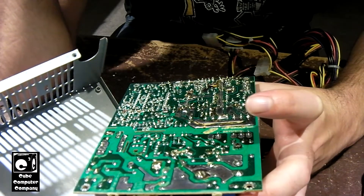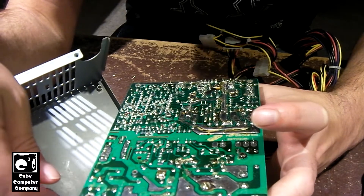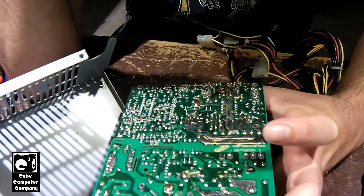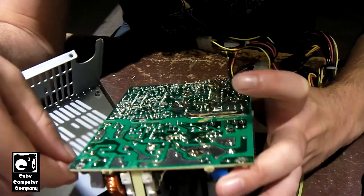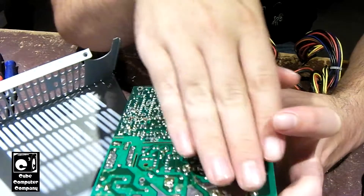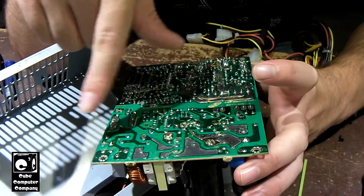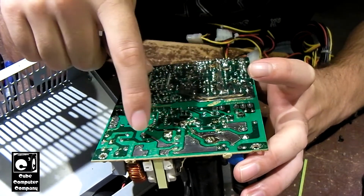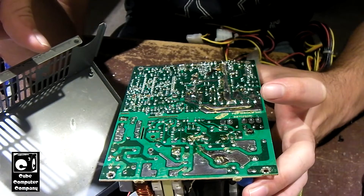There's a chance this thing may have been exposed to humidity. I don't see any rust in this thing — sometimes these things do get a little bit of rust on the surface of the case, but not sure on this one. I want to say everything in the high-voltage section is fine; it could perhaps be something to do with the switchers or something over on the low-voltage side that could be why this thing isn't working.